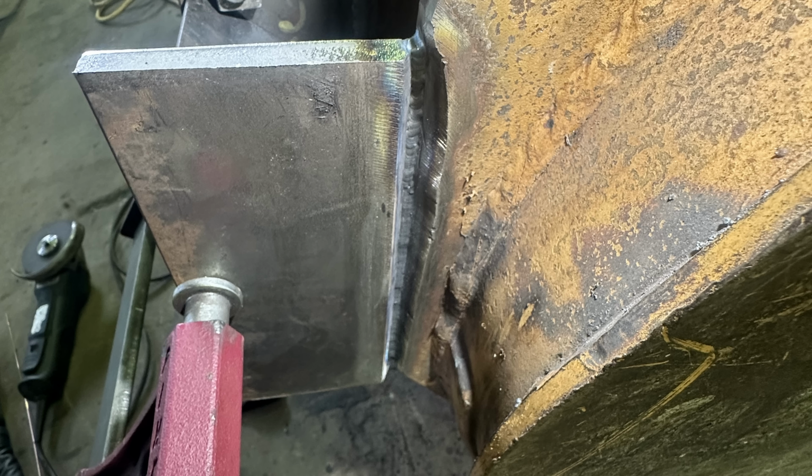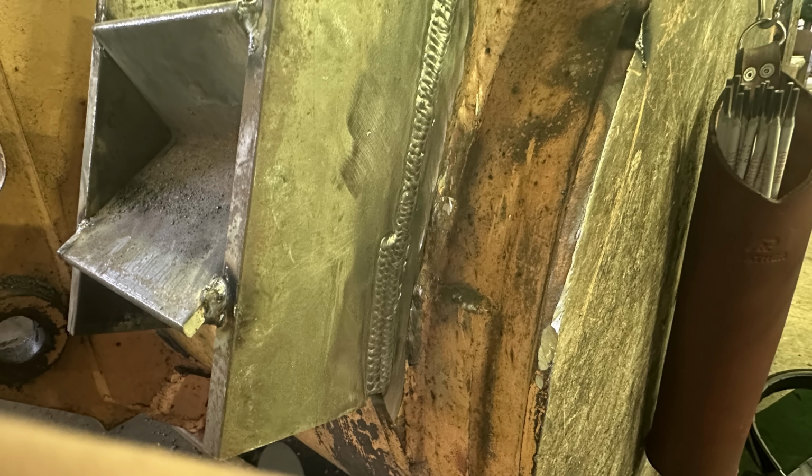And again, zero risk of weld defects because I can see what's going on, versus stick. There's a certain element of, I don't want to say hope and a prayer, but if you've done enough uphand stick welding, you know what I'm talking about, especially on something like this. So I think I was about 4 passes deep, and I weaved the cover pass and the second to last pass, and this is the end result.